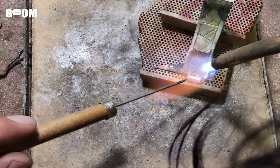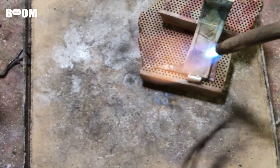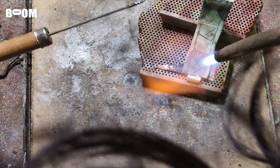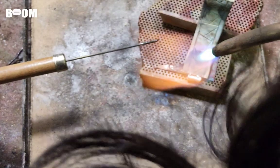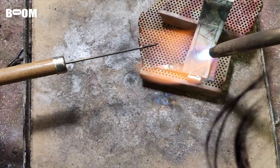So I'm going to put a couple pieces right there. I try to heat sink this hinge when I put that back tube on. I try to put a piece of metal on the hinge to block the fire from really getting there. But this big mass gets so hot at the same time that everything comes apart. So I'm learning that when you're going little mass on big mass, it can be really tricky, especially when you have multiple solder. I've never worked with 20, 22 gauge, 18 gauge sheet. I've never had parts fall apart in succession solder jobs. So, you know, I'm learning.